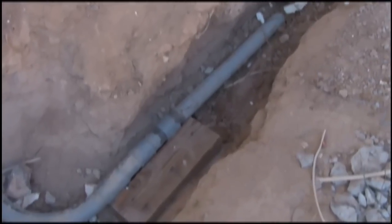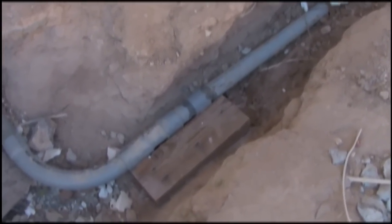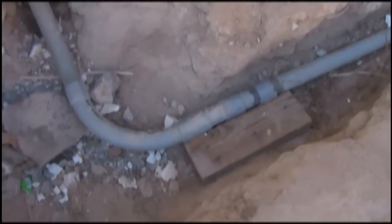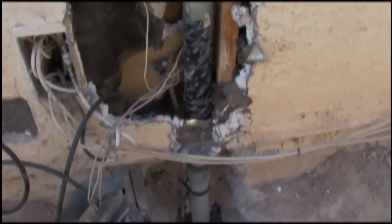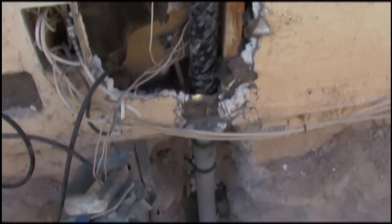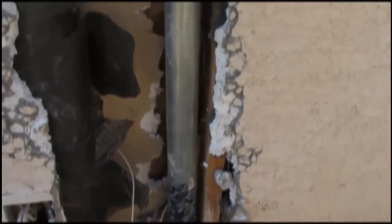Code requires that any sub feed or underground burial conduit be in plastic at least 18 inches deep. This is 24 inches deep, and right there is grade level. It switches over from plastic to metal — you saw me put the bushing together, and that's all pipe wrapped, inside the wall.